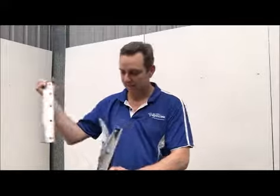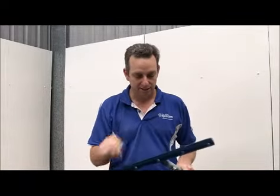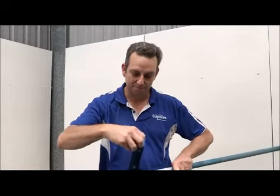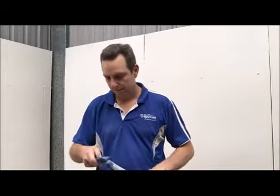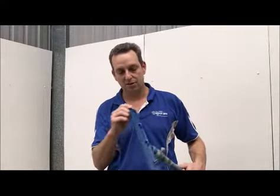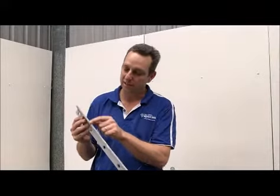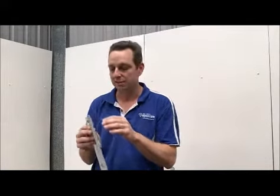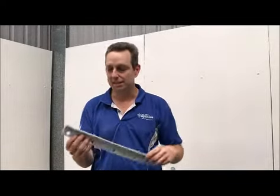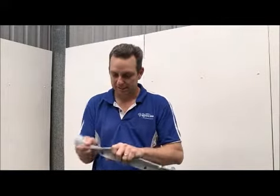So let's pull out the rubber and see what happens there. Again, the other side of the plastic is coming off cleanly across all of it actually, so that's good. If I can get an edge there, can't quite get an edge. Anyway, you can see that it's actually coming off cleanly, which is good. There's nothing stuck in any places on this part of the rake. The rubber itself, this is the key, whether you end up with clean valleys again, so you've got accurate measurements next time, or whether your valleys end up filled up with resin and then therefore distort your calibrated film thickness next time. So let's have a look.